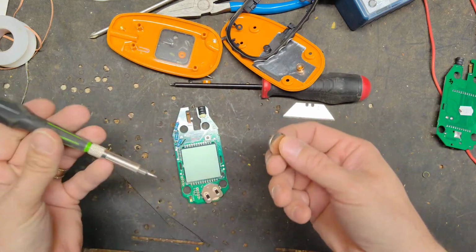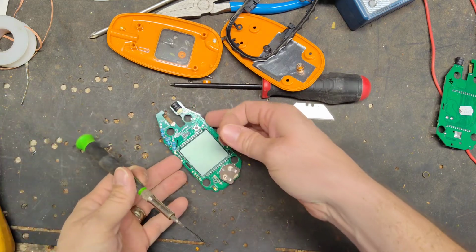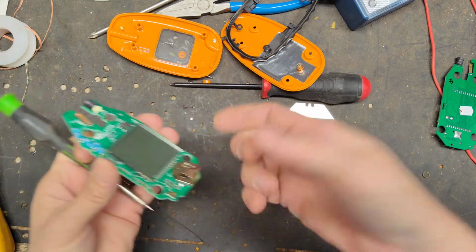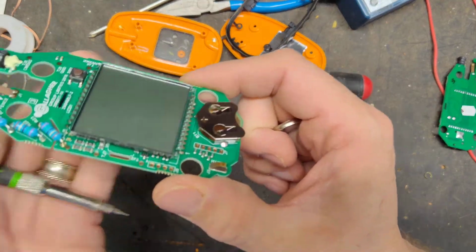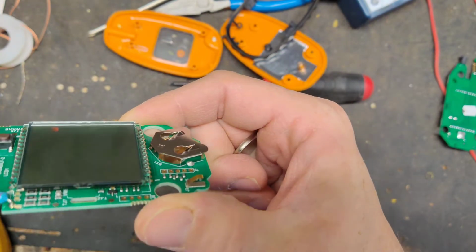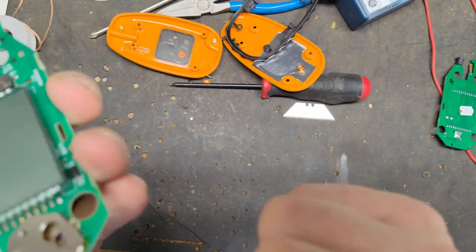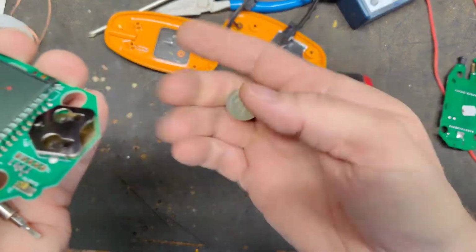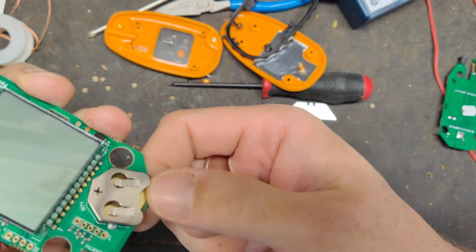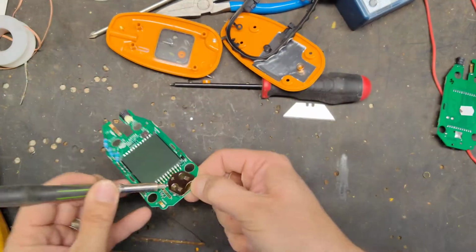Alright, so we're going to take this flat screwdriver. Need to do a reset on it as you put the new board in, or new battery in. You go at the back edge of the board, or back edge of the battery holder, this little silver piece. There's an opening right here, and there's a metal plate on the bottom where this battery makes contact with this and the bottom plate there. And you go at the back edge there, kind of go to like a 90-degree angle.